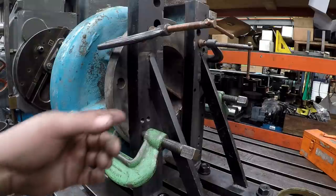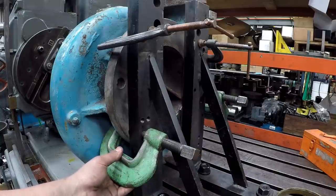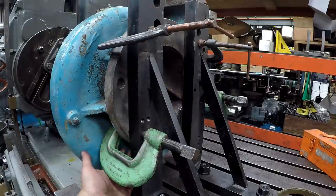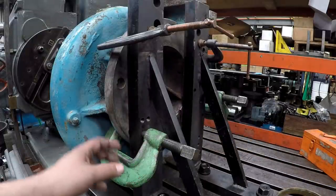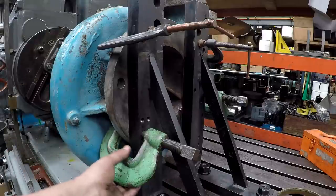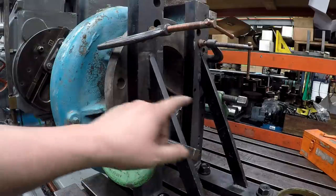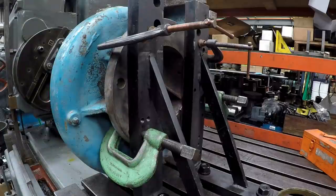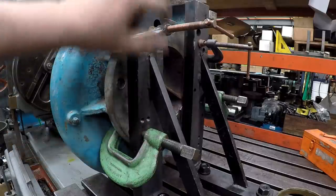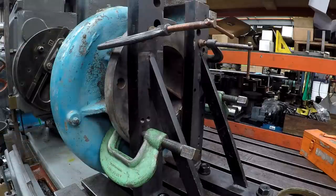I don't think I showed you the back of my setup earlier, so here it is. I'm using heavy clamps to hold it up there with shims on the bottom side — you can see one sticking out there. With this being cast iron and these heavy clamps, this has always been a pretty good setup. These are some angle plates that I had made up myself — me and my dad actually built those together. A lot of the holes in here are from different things we ended up drilling and bolting parts to for fixturing.